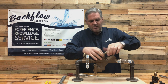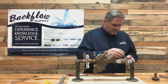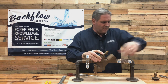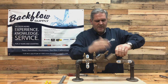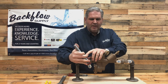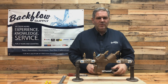Put the cover back on and tighten it. For the number two check, same thing - seat, poppet assembly, spring, retainer, quarter-turn, straighten the spring, push it into place, and tighten the cover. Make sure you turn all the test cocks back off after reassembly, then turn the shutoff valve back on slowly and you can hear the water fill and go into your lines. Once you've got it fully on with no dripping from the vent, you know you've done it correctly.